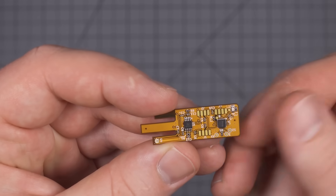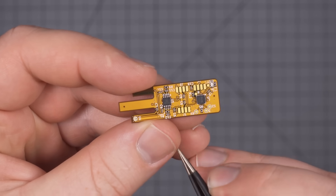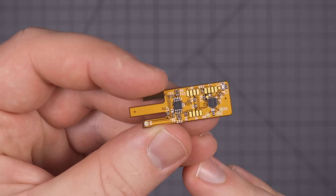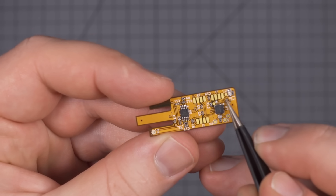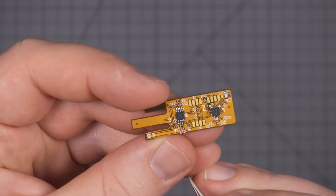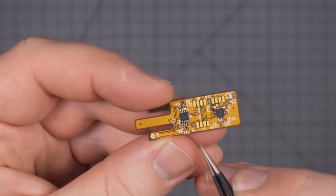So now that I've covered the pins, here's what I plan to do with them. If you've been watching my channel, you might have seen the project where I'm turning a tile backsplash into a big display. For this project, I'm building around 200 circuit boards, each one with a microcontroller that needs to be programmed. Here's the board up close — they're small and cheap at just half an inch by one and a half inches. There are a number of pads here that wires will be soldered to when these are installed, things like power, ground, and signals for the LEDs and microphones. These four go to the serial wire programming interface, but there are a few one-millimeter circular pads spread around to let me probe other signals like the analog microphone signals. Ideally, my pogo pin board will connect to these.